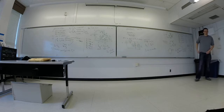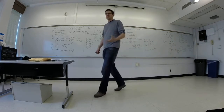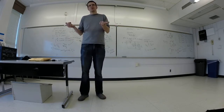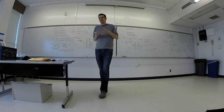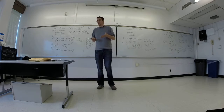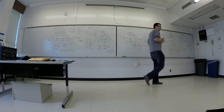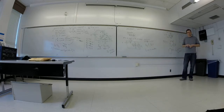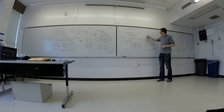The hope is, of course, that the decrease between what it is before you put the measurement device in and afterwards is so little that you don't care. That's the whole point of measurement, right? You don't want to be a wrecking ball. You want to go in there and be as unobtrusive as possible in your measurement, right? So if we were to try to minimize the wrecking ball aspect of the ammeter, should we have it be a small resistance or a big resistance? Small resistance. So for an ammeter, we want to have it be a small resistance. That's the key.